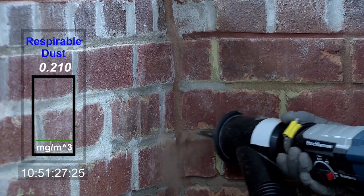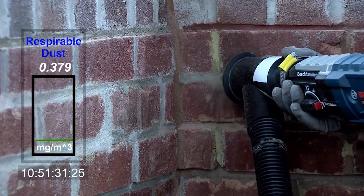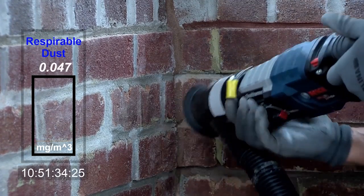Next, I'll show you how to work in corner spaces and score vertical joints. If you do find you're damaging brick, select a thinner mortar knife for the job or choose a different tool.